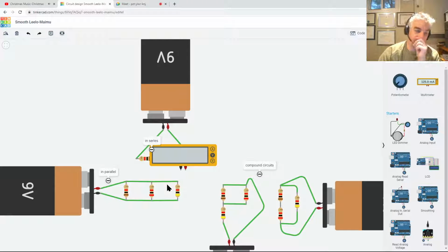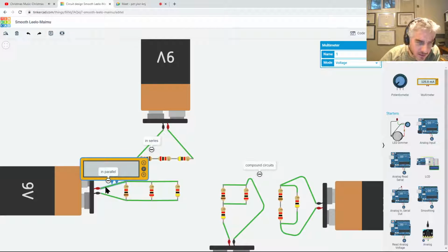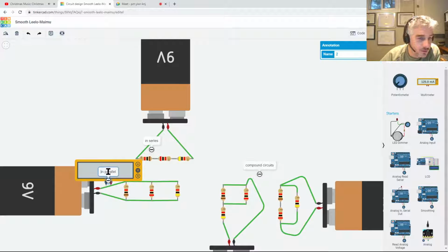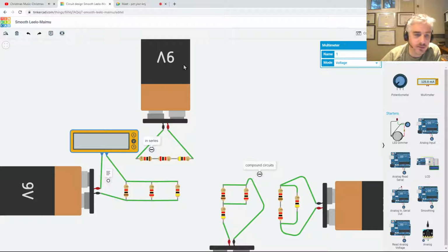Now it's my IT versus I1, I2, I3 that will get interesting. So let's go back here. To measure amps for IT, I need to interrupt my whole circuit. I need to open here, go to this terminal, and then wire here. Notice all my current has to go through the ammeter. If I start that, okay, that's really strange. Okay, so that's my IT: 15.7 mils.